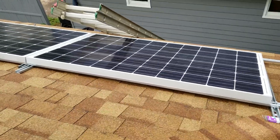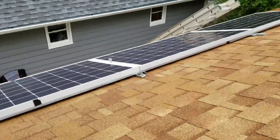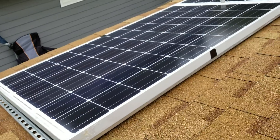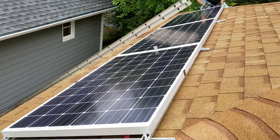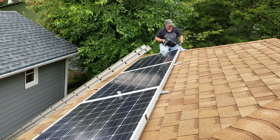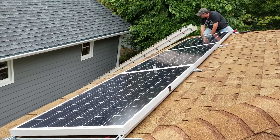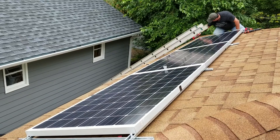Now that we have the panels up, you guys can see three 300-watt solar modules are up. We have them all with clearance so the water can go through — it's almost about an inch and a half. With the unistruts we build the thing down, and we're trying to bring it all the way up. It's not easy — we tried designing it up here but it was kind of difficult. Keith is going to be the guy putting the holes on the roof.